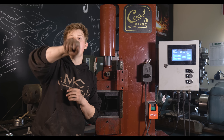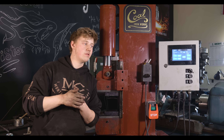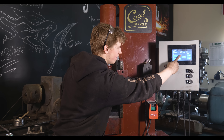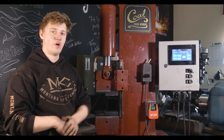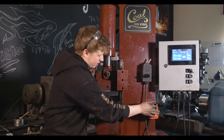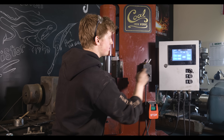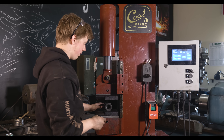I've had times where I thought a billet was at one dimension and it turned out to be at another dimension, or I wasn't able to rotate from square side to square side like I wanted to. I can very quickly set my top parameter to have that room by hitting 'set from current.' So say you want to forge something that's the same width as this nut right here — set the bottom set point, come up, set your top set point.